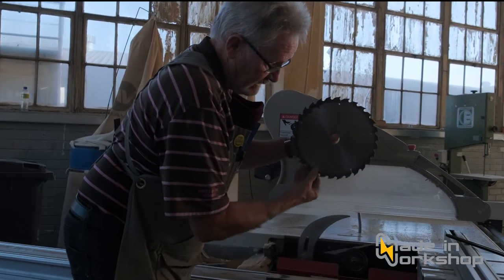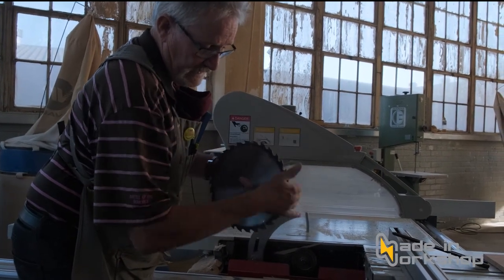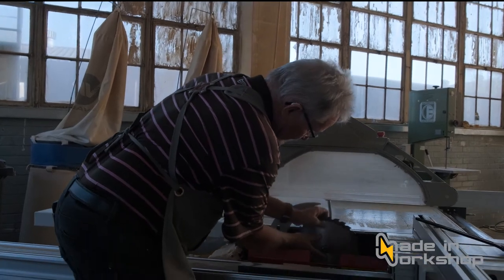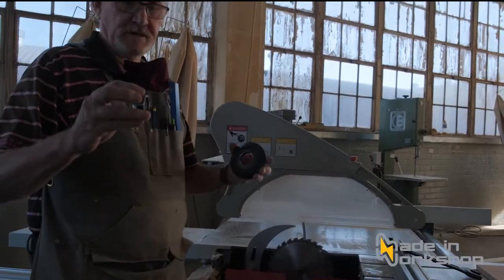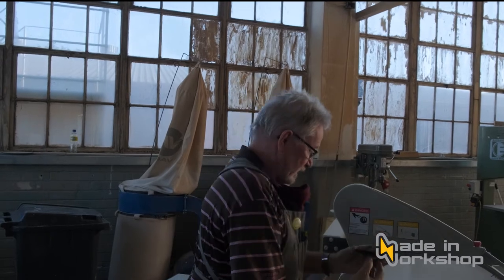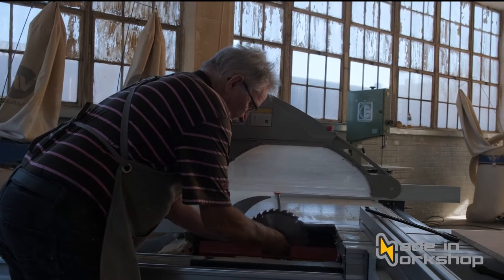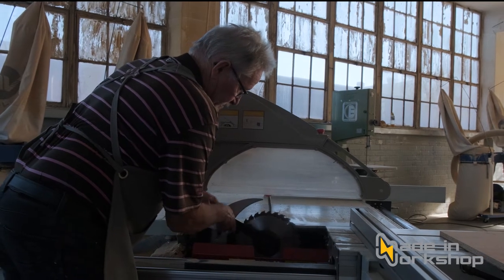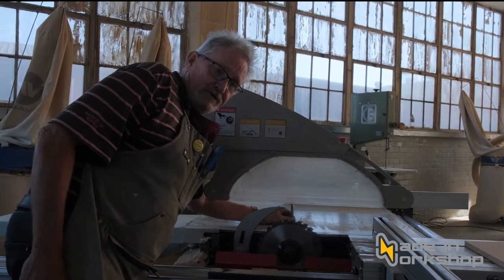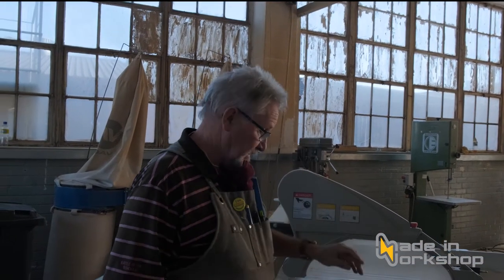The blade turns in this direction into the wood — not the other way. I'm going to put it on, making sure it centers on the arbor. In this particular saw I like to take the nut and collet together so I'm not misaligning the collet. Left-hand thread, so I'm turning it backwards to tighten. That pin is still in there — I'm tightening it to the left. First thing: please make sure you remove that pin, because otherwise you try to start the saw and it can't run as it's being locked. Then close the door.